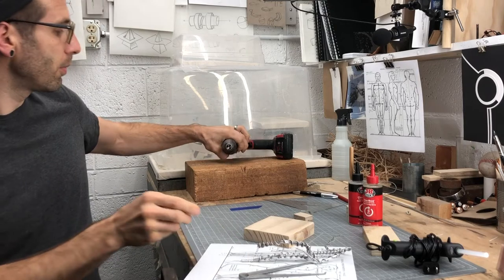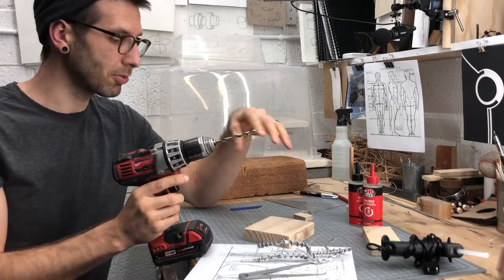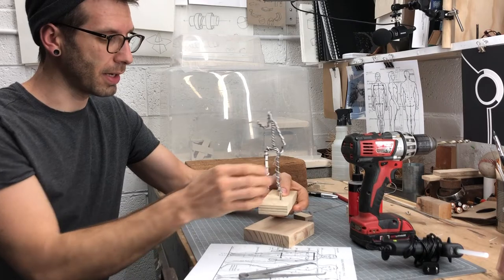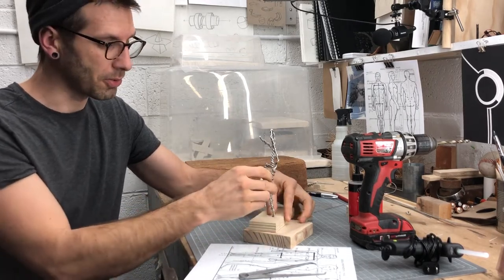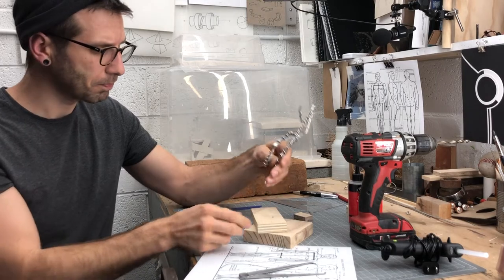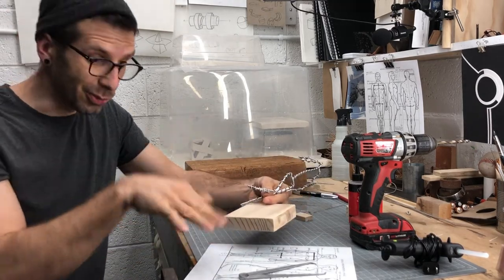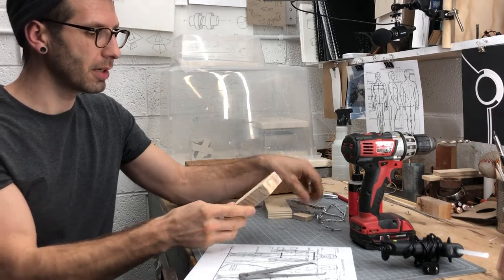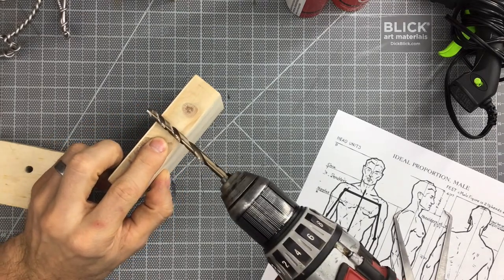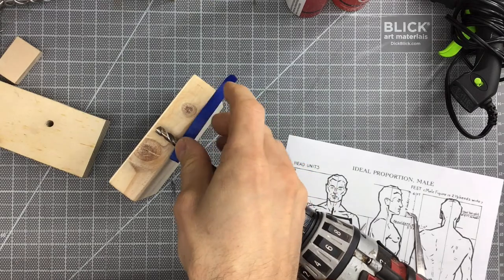We're also going to use a drill with a drill bit pre-selected to be about the right diameter. If you're not sure of the diameter, drill into a scrap block first and check the fit — you want a tight enough fit to get the two wires in, but with a little bit of room for the epoxy to fill the rest of the void. I'm going to drill up partway through the block — I don't want to go straight through, so I'll mark the drill bit with a bit of tape to indicate how far I can drill before poking out the backside.